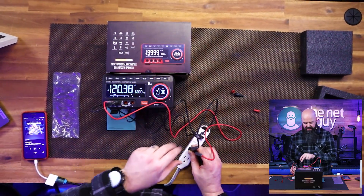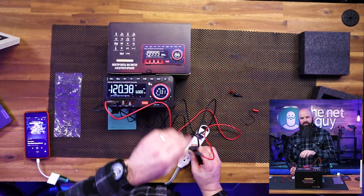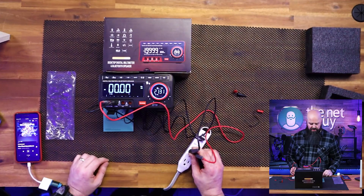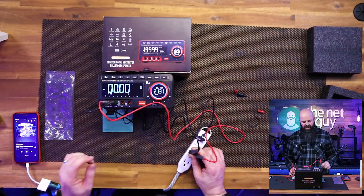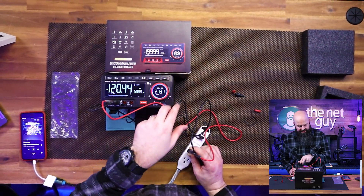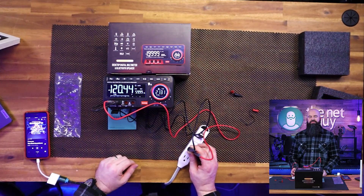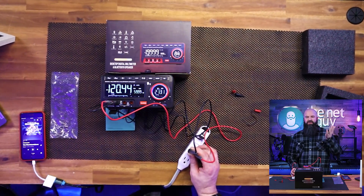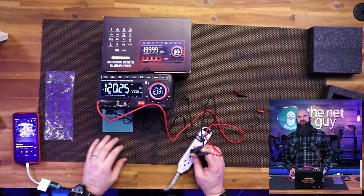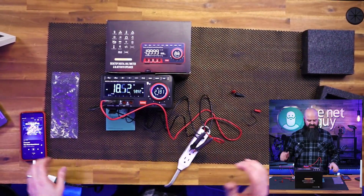You can also use min and max capability — it'll show the max value we've seen, or if I want to see the minimum for a voltage drop I can do that. We can also go to relative, so if that was the baseline it's going to show you what it did up or down. You can even combine these — hold the maximum value, which happens to be 120.44 volts. Same with min — it'll show you the minimum value in the sampling range.